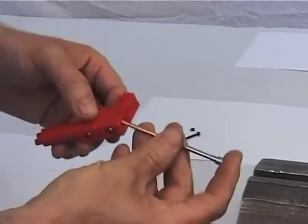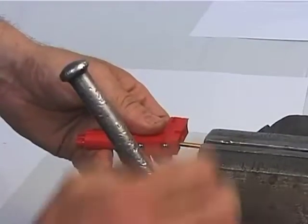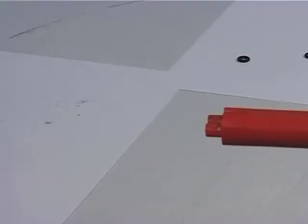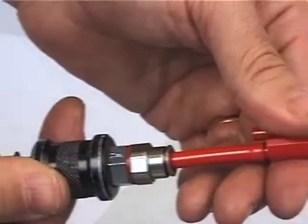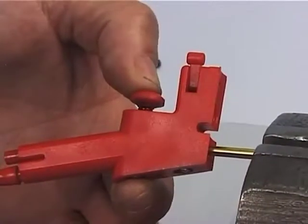Insert a peg into the rear hole of the valve body and fasten it in a vise. Connect the air feed to the valve body as shown in the movie and feed with pressure of 6 to 7 bars. Act on the push button, figure 44, and on the lever for inlet opening, figure 43, to check for the correct operation.